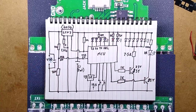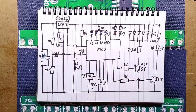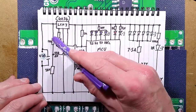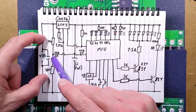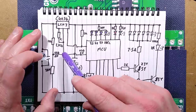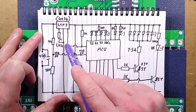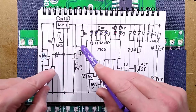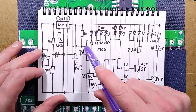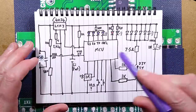Looking at the schematic itself — it's very straightforward, I was expecting more. The USB incoming supply has a capacitor across it, feeding up to the LTH7, which is a TP4054 in disguise. There's a resistive divider providing a safe microcontroller-level signal — you can't supply five volts directly to the microcontroller, which operates at about 4.2 volts maximum. The resistor on the LTH7 sets the charge current. By comparing the charging and charge-complete lines, the circuit can tell when USB is present and flash the LED to show charging status.